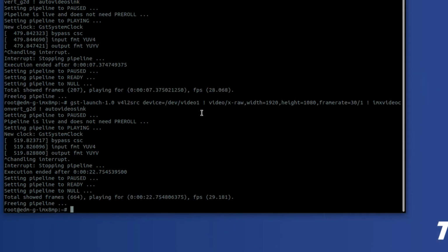Now, the next thing that everybody wants to see is this HDMI input. So for that, we'll have to do something a little bit special here. What that means is we'll have to change the device tree for the kernel. Now, fortunately, we've set up a number of different device tree overlays, and these should be included in your image that you would download from the TechNexion download server.